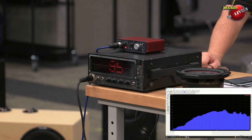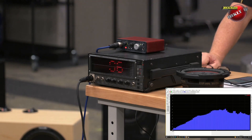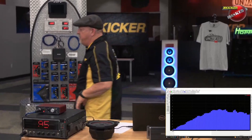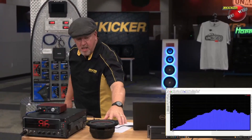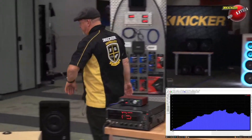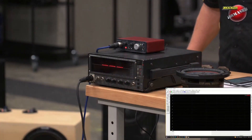Back to 95 dB in polarity. So again, about a 17 dB gain — that's why it's very important to make sure your polarity is wired correctly. We got a 17 dB difference with the common chamber sealed box. Let's go ahead and do the same thing with the separate chamber box, going back to pink noise.